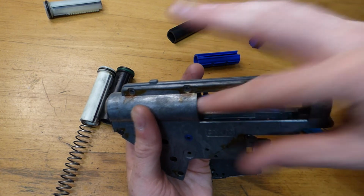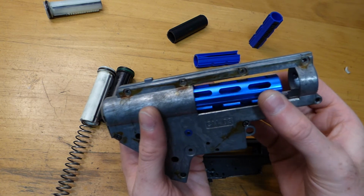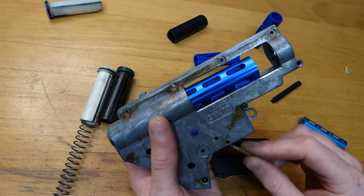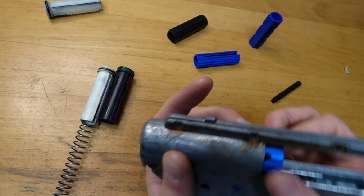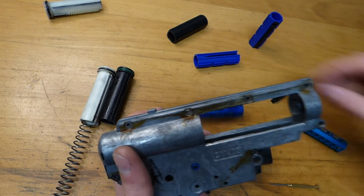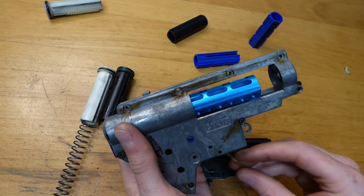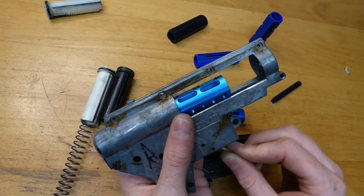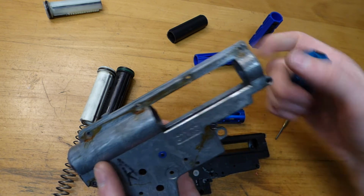you put that in there, that free flows quite nicely, and even when we engage the tooth, because all I've got in here is one sector gear, so that's now got a sector gear on it, and that quite happily moves back and forth nice and smoothly. This one also will go in. Two will move back and forth smoothly. So in that gearbox, it wouldn't matter which one you used.